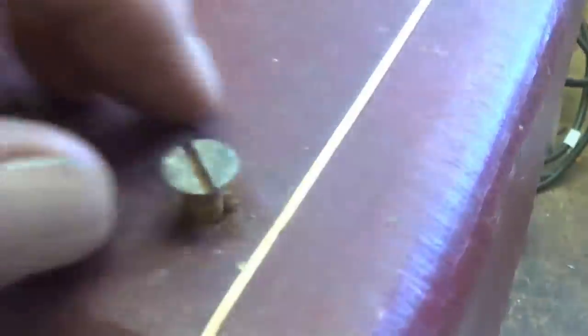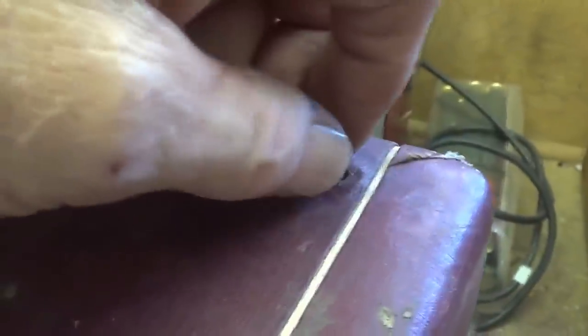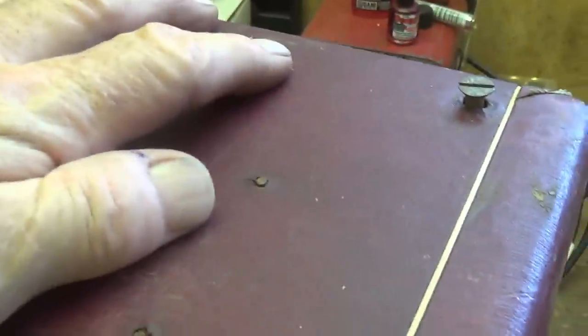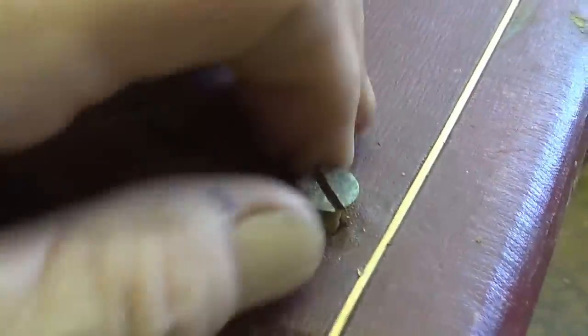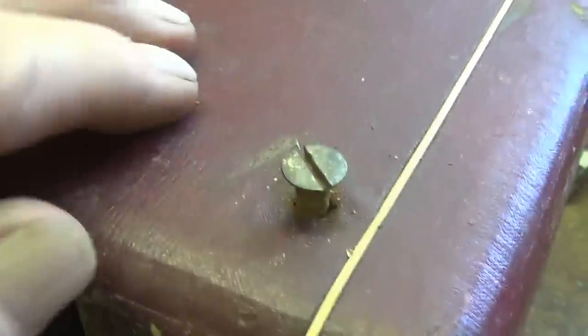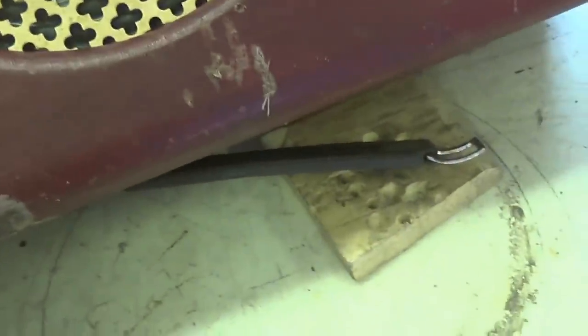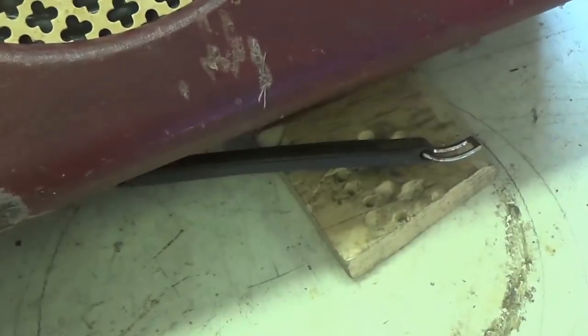While I was hammering away on those staple legs, I noticed the wonderful cushion feet on the bottom of this amp. You know how happy your wife would be if you set this down on her Louis the 16th parquet table and dragged it around a little bit. So let's put some decent rubber feet on it while we have it upside down. Okay, there's four original style feet held on with number 8 nuts and bolts. So let's finish attaching the handle up here on top, and then we'll be ready to put the chassis into the cabinet.